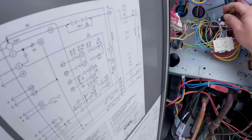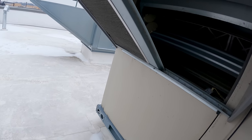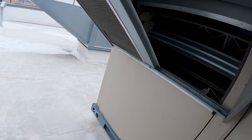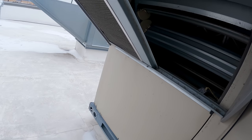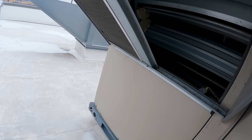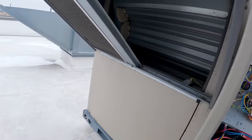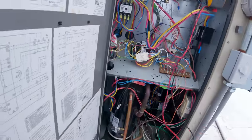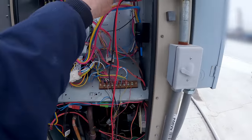Now that we're not in winter or summer we can set minimum position back to normal. That's partially what's going on here — they've got the makeup air unit cranked up probably to make up for not bringing anything in through the economizer. We've got that bringing in some air. Of course this filter will get trashed before you know it. Let's see if we've got a call for cooling yet. We do not — let's go down there and find out what's going on with that.